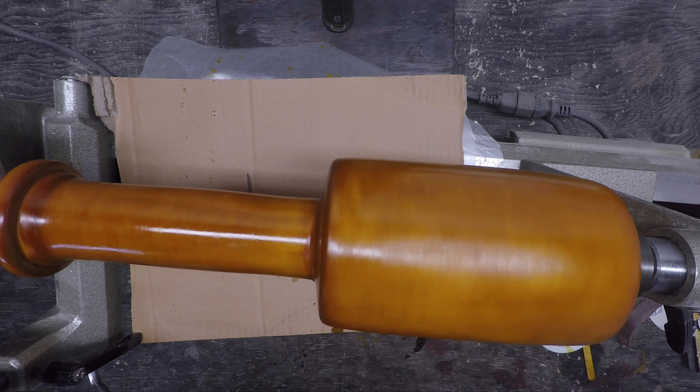Here's my second mistake — the 400 grit is too fine of a grit for a between-coat sanding. But shellac burns pretty well back into itself. I'm not doing a polish or anything — I'm just running a very fine, very gentle sanding over the top of that shellac, just trying to kind of even it out. If you're going to do between-coat sandings, you'll probably want to stay around a 220 grit, 320 maybe at the tops — but 400 is kind of pushing it. And here's my other mistake: I'm touching it with my hands. Once I get into the sealing process, I try to keep my fingers off of the sealer as much as I can — I'm always using gloves. I don't want my finger oils back on the sealer. I don't want to take any chances of any variables creating some kind of misruns or defects in my wood sealing application.